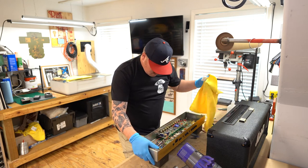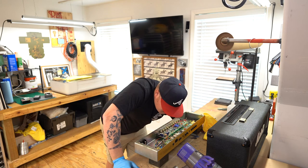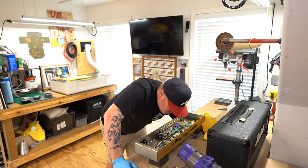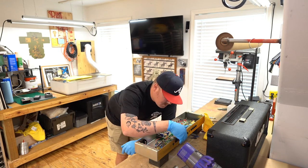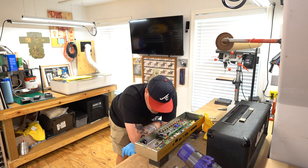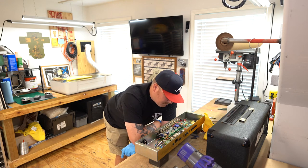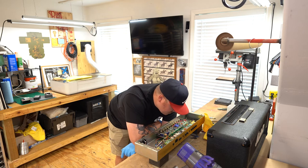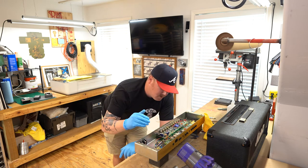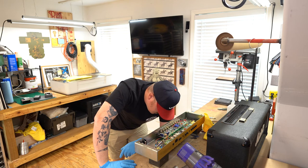So next thing to do. Okay, I've got four burnt resistors. Okay, so there's burnt resistors on the two fuses, the smaller fuses, and it looks like, right next to them, they are the resistors for the LEDs, which is kind of weird. They're definitely the same value resistors throughout. And I don't know what that value is, but I can at least tell, with the resistor code, the four burnt resistors are the same value, which is kind of odd.